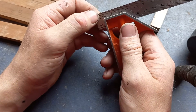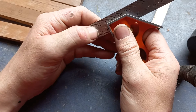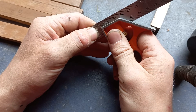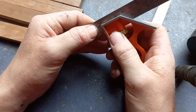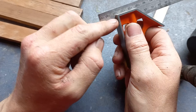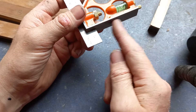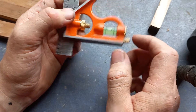Now, say for example with this square here, let's take this to about 20 mils. You want to take this to 20 mils. Now that there is basically right on the 20 mil line right there at the edge of the square. So ideally this face here should be 0 and this face here should be 20 mils.